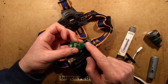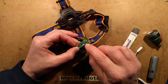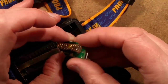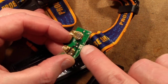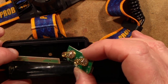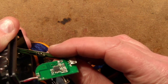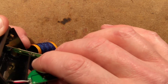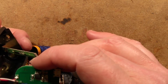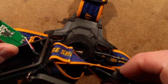B plus and B minus - it is literally just putting the battery voltage out, so this is purely a charge control chip. The two LEDs are under here - they're the ones that shine through the back of the panel in the battery symbol. We've got the positive connection, a negative connection, the positive coming through the circuit board which has a little generic six-pin chip in it, the LED, a button, a few timing components, and a resistor for the LED. That might just be a little pull-up resistor for the button. This is just a charge control chip and the power goes straight out to the head.